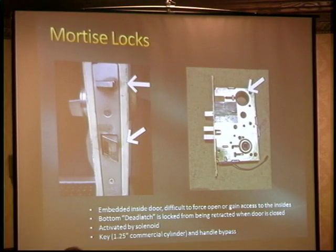These are built this way so that when you hit the solenoid, these things either fail safe or fail secure — either applying power to it opens it, or releasing power to it opens it. In the case of fire exits, it's more common to be fail safe. These will become retractable: either the act of turning the doorknob retracts them, or in a lot of cases, just the act of opening the door collapses those little dead latches. They capsize into the door pocket and you can open the door.